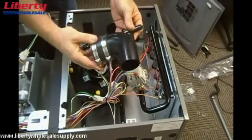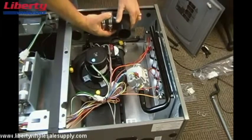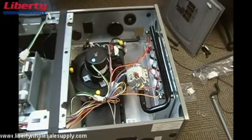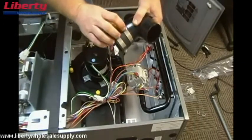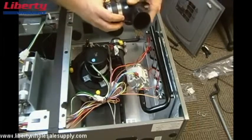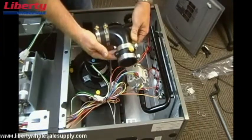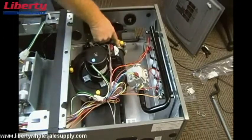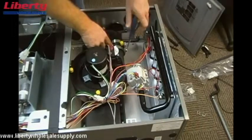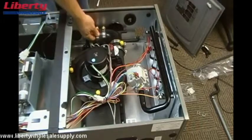The next step is to assemble the elbow back into place. We will rotate it 180 degrees from what it was in the upflow position. We need to loosen the hose clamps enough that we can rotate them so we'll be able to get to them and tighten them later. With the hose clamps loosened, we'll access them with our 5/16 hex head bit. Put the elbow onto the coupling and install it back into the furnace. Tighten the one on the inside closest to the inducer to keep it in place, and leave the others loose so that when we get ready to attach the vent piping we can move it around freely.